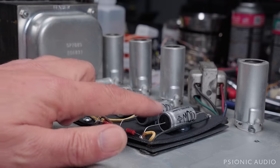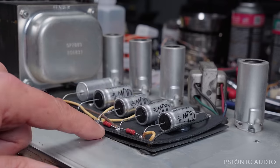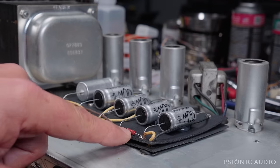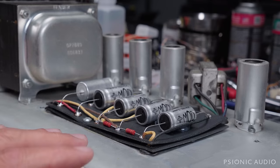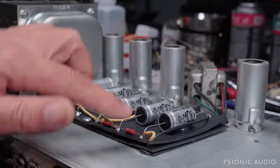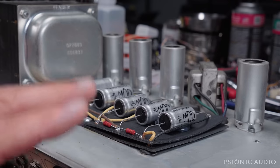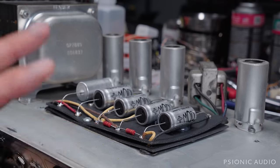And then three 20-microfarad caps — these are 500 volts — and the 1K and the 4.7K. When I do this, I take everything out and clean the board, all old solder out. The new leads are bent under, just like I showed yesterday on the bias board — the bias and rectification board.